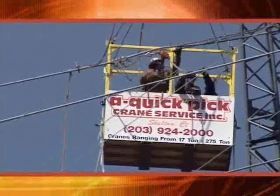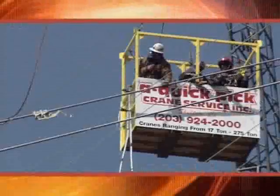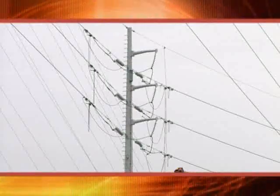This kind of thing doesn't happen every day. Here in Norwalk today we've got some splices that we've identified as bad splices, so today we're here to replace these splices. We have a 188-foot crane that will be using a man basket to access those splices. There are three phases up there and it's double dead-ended, which we'll have to rig up both ways on a phase at a dead-end.